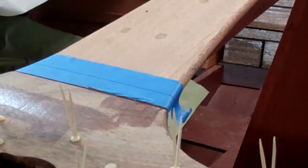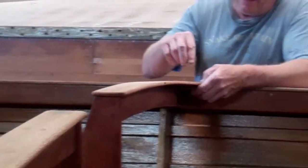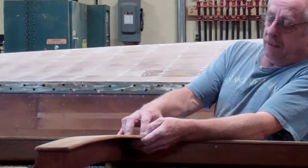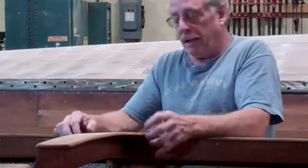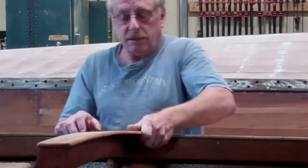When you try to sand them they wouldn't sand even. One side had a block under it but only had two screws in the pass-through board, and the other board was just sitting on top of the block without enough block to get screws in. I made a wider block matched to each side and got four screws in each one. It's all solid now.